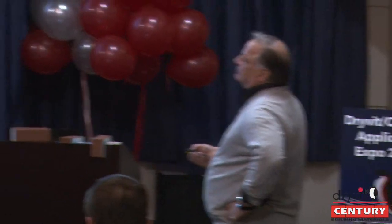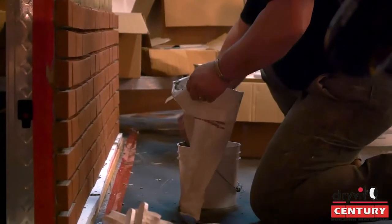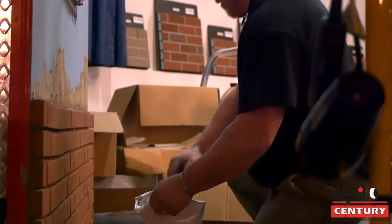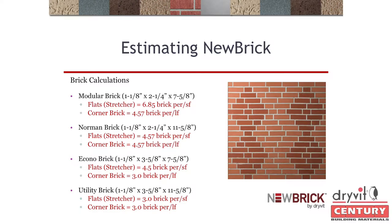The cap unit is for an overhang, a cap, or a soldier course at the end of the building where you make your return. We also have a 135-degree angle — very typical — but we can make any angle you want: 120, 137, 140, 150. I was in the brick industry for 30 years, so I know how these shapes go, especially on high-rises where a variety of shapes get requested. A custom shape is not a standard item and has to be manufactured.